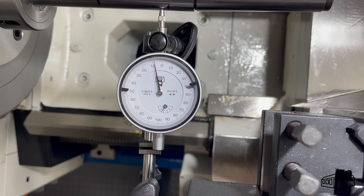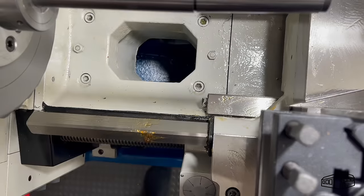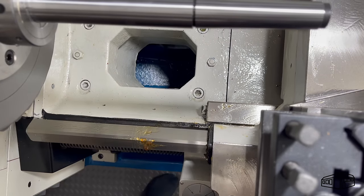It's looking like 5 microns at the collet nose, maybe 6 or 7 at 50mm, and 8 or 9 at 100mm — but that's all less than a hundredth of a millimeter. There are differences in the observations and that would indicate possible actual runout. This may be in the chuck, or it may be in the collet, or a combination of both.